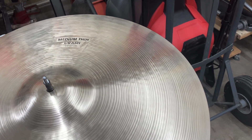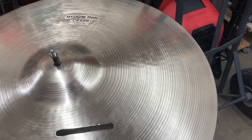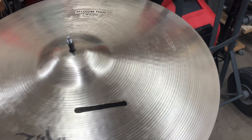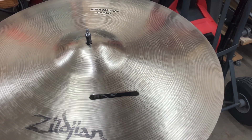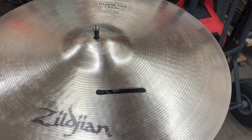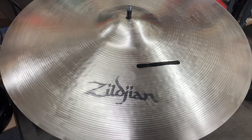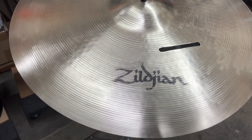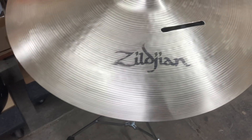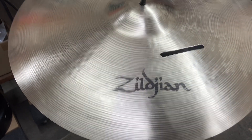the scotch-brite wheel, because if you try to use any kind of sanding device they have an orbital action and it just leaves squirrely marks all over and you can't get rid of them. I tried it, so the only way out was to go with the scotch pads and follow the lathe lines and just do it by hand — take your time.